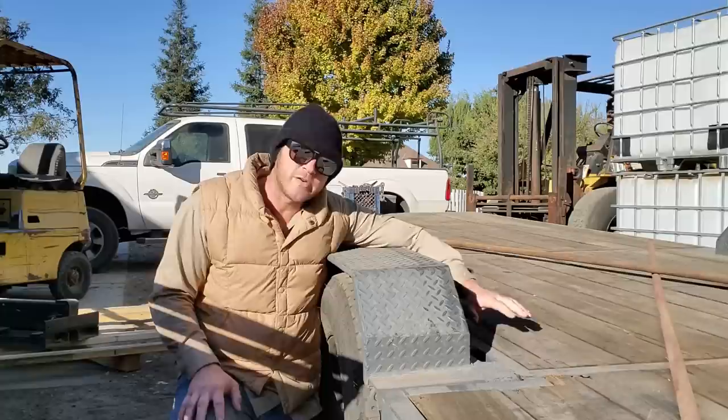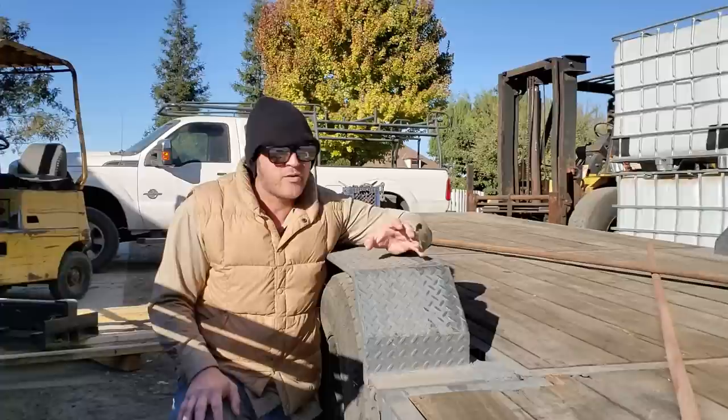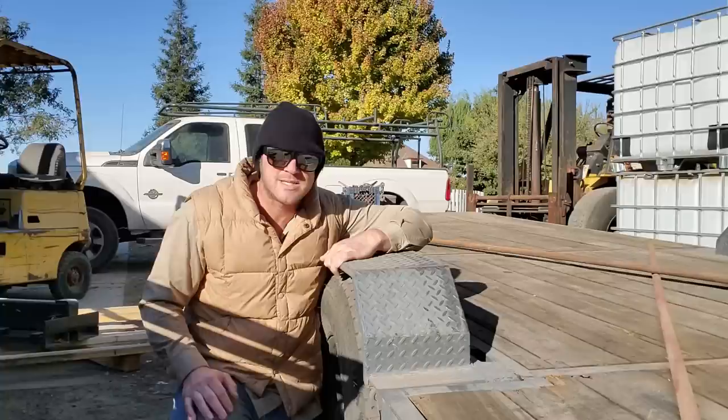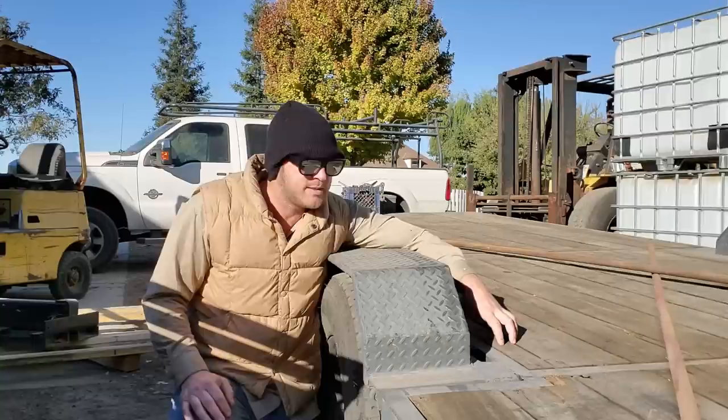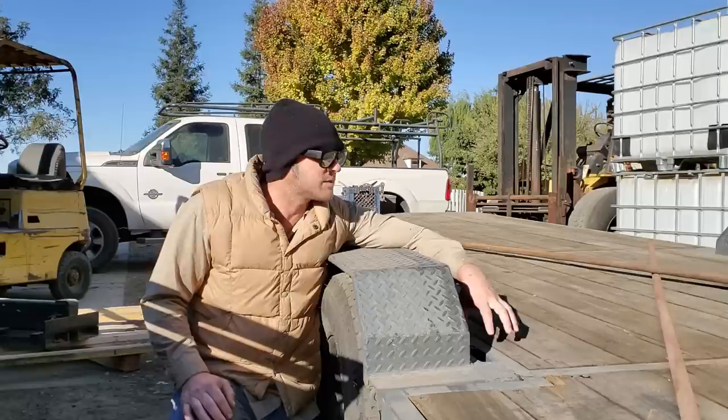Wood versus steel was another toss up. Personally, I prefer wood because I haul a lot of steel, and steel on steel can get really slick, especially during the winter months. Wood is a little bit cheaper outright, and if you keep it sealed, it does hold up pretty well. Since I originally did it, it has been sprayed once now with diesel, and once with a regular oil-based sealer.